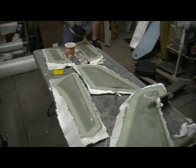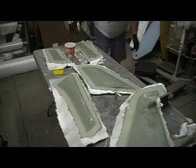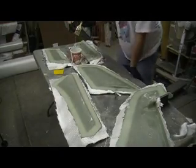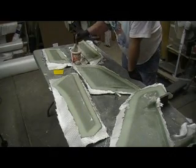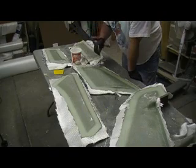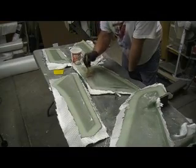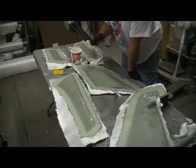It's heavy cloth, but if you don't have heavy cloth, or you don't want to spend the money for it, or you don't have enough, you're going to need about seven or eight layers of ten ounce. And that's why I use it, man — it cuts the work down dramatically. Takes a long time to put eight layers of cloth on. That's work, man.